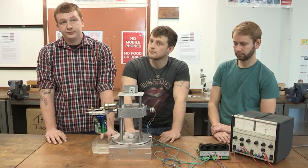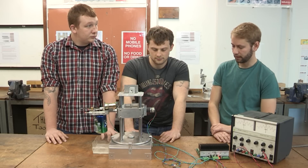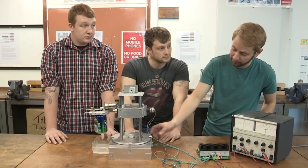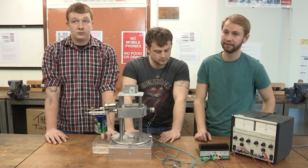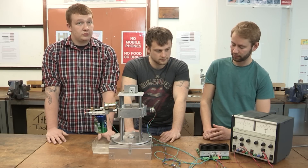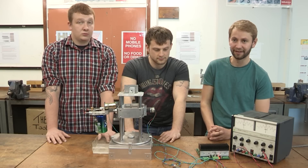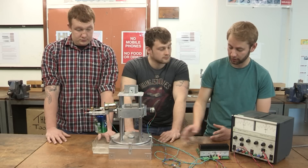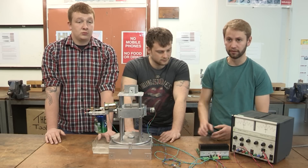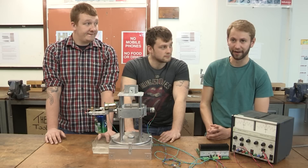The base is made of sheet aluminium. It was a pan and box fold. Initially we were planning on doing it from a single piece and milling out all the material we didn't need, but it wasn't cost effective at all and would have taken three times as long, so we ended up just using a sheet — almost basically a net — and then folding up the edges and fixing the corners together, and it did save a lot of weight and a lot of time.